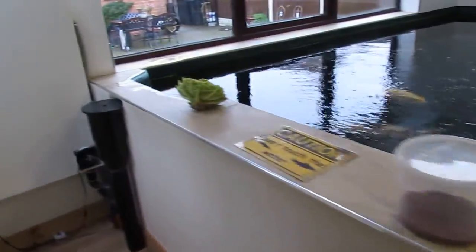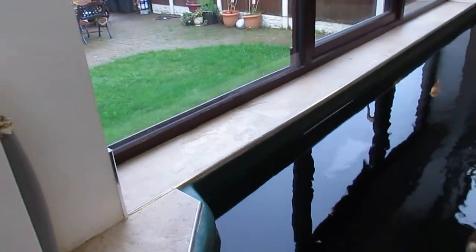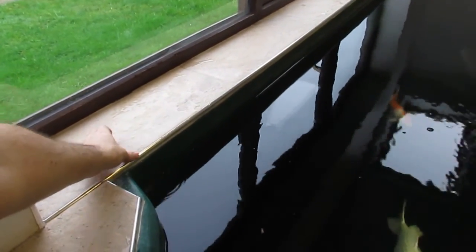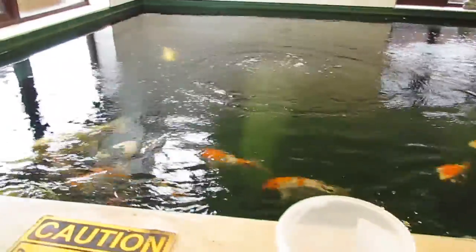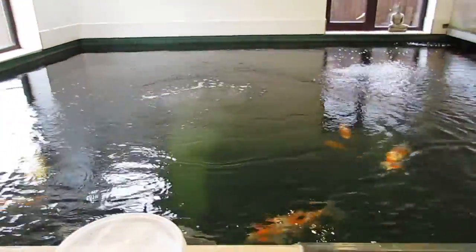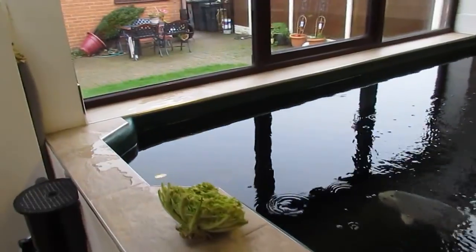And by that I mean these walls are foot thick walls, so the 300mm walls, and what you get is 100mm of brick or 100mm of concrete block, 100mm insulation, and then 100mm external brick on the outside wall, and that insulation keeps any wind that's hitting the outside walls from affecting your pond at all, and that dramatically increases the pond's heat retention because of that.